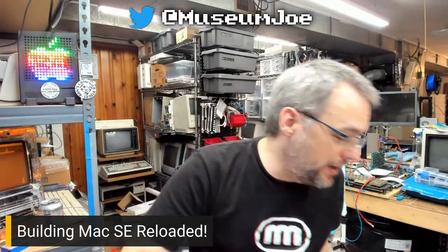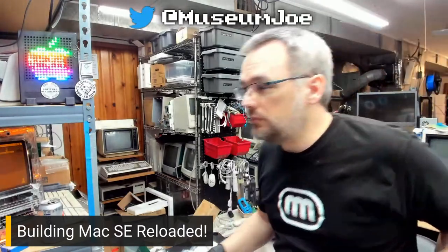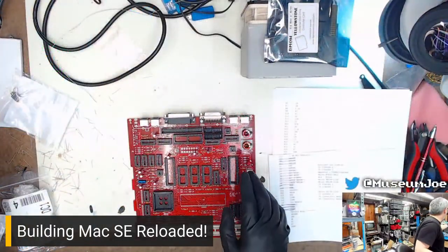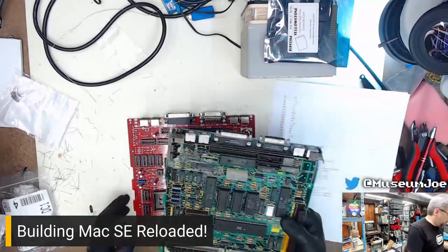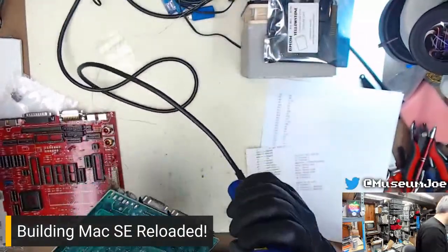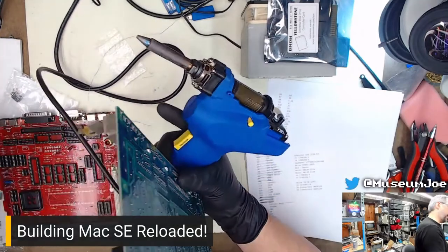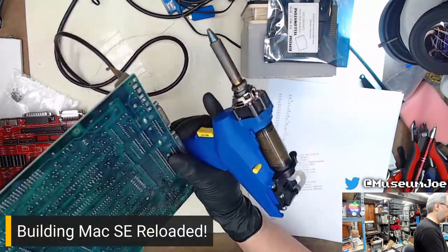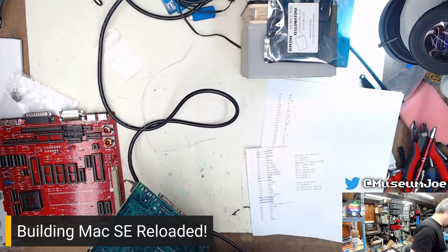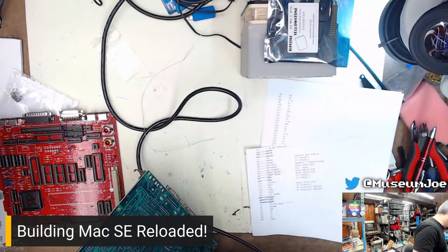Anyway, let's get back to doing some things. I'm not quite done for the night yet, so we're just going to keep going. We need to switch a doodle back to bench cam, because we need to take this ferrite bead out of this board. Right here. L4. Where is it? There. This one? Looks like it's this one. Yep, I got it. I'll figure it out.